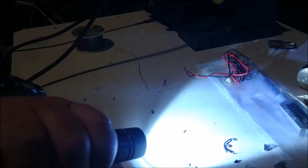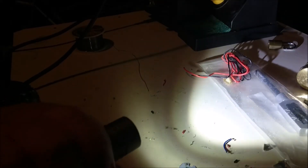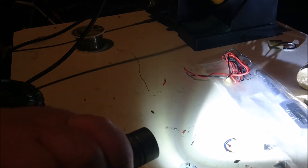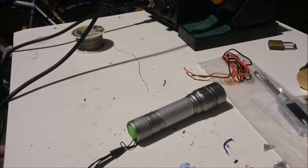So the light does work. That's low mode, and you've got blinky, and you've got high mode. You can see it is a lot brighter now. About heat dissipation — I'm not sure how much better it is, but it will be at least a little bit better. The stock driver that I'm still using — the one that came with the light — isn't going to be able to output that much power, so it's not going to be too much of a concern. I'm more concerned that the MCPCB, the copper board, is sitting flush against the piece of alloy — which when I checked it was. So we'll take it outside now and see how it does.